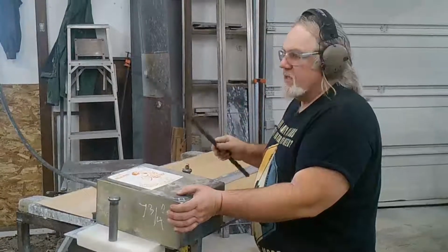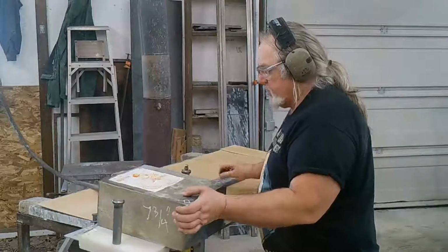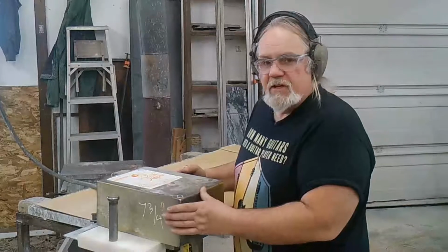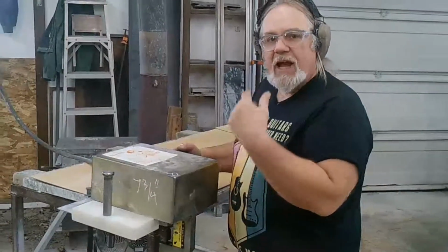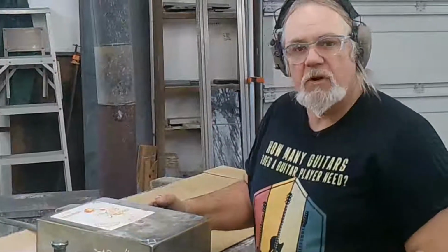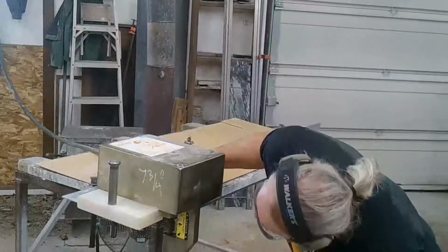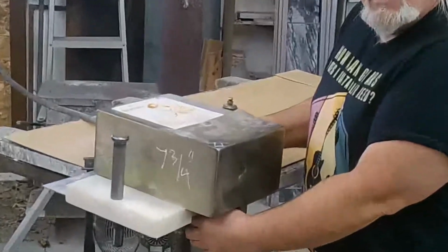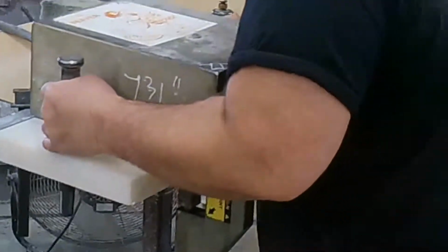So we take this half inch piece of square stock and we put it behind the machine so that we can't go back any further than that half an inch. Then as we go, we do the half inch and take it out, and then we'll do the other half inch wherever we need it to get the desired look that we're going for. So in the end, we take a half so we don't break the corner off. The tooth down here, you might not be able to see, is going to be half on, half off for the very first bite.